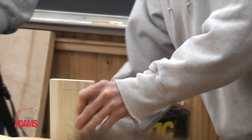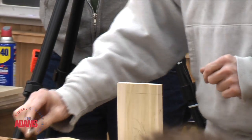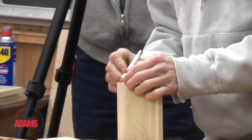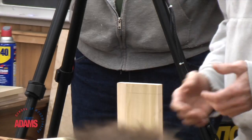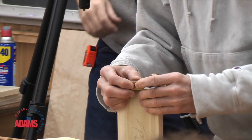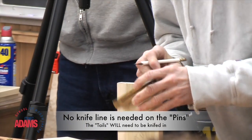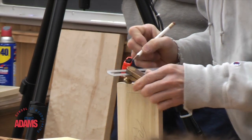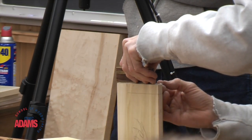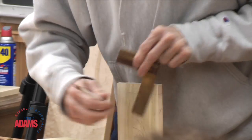The front piece goes first, so I'm going to put the front piece into my vise and draw out my angles. In my mind, from this pencil mark over here, I have to pretend that extra width doesn't exist — I'll darken it all in so it's no longer there. What I've got now is a dovetail just like we did yesterday. I can set up my angle, use a pencil because I'm going to be sawing this first line. There's my first angle, there's my second angle — these just get dropped down to the scribe line with the square, and we're ready to cut.